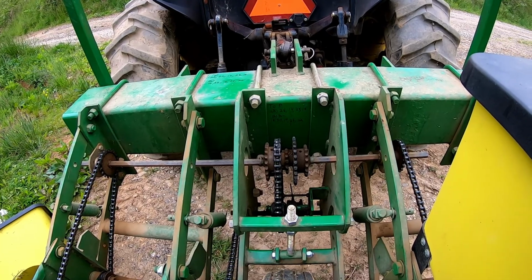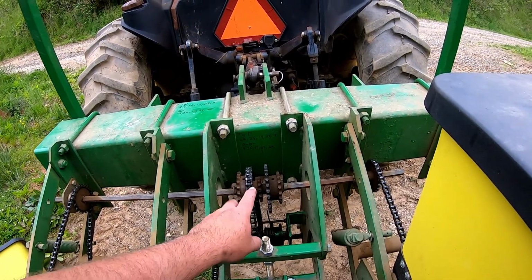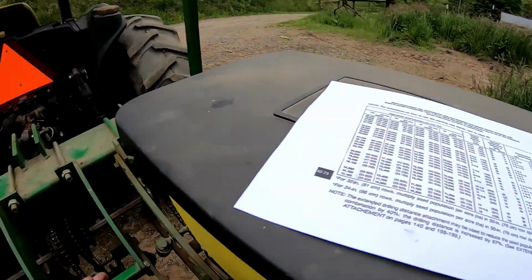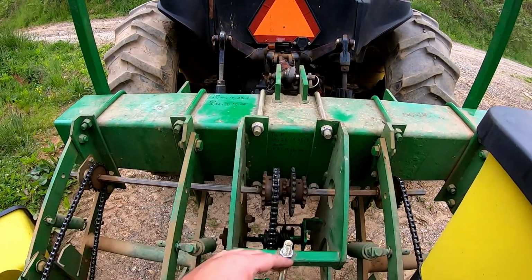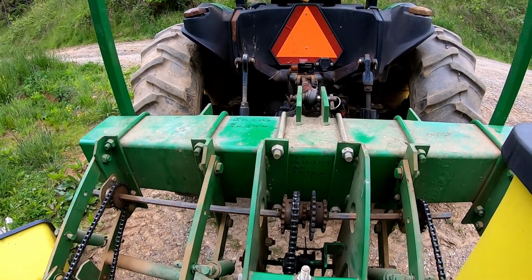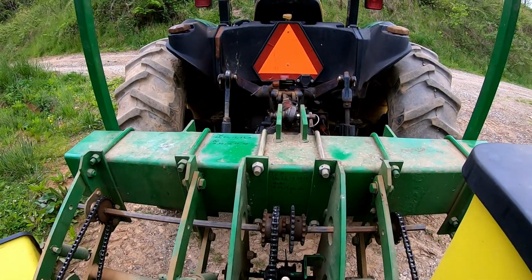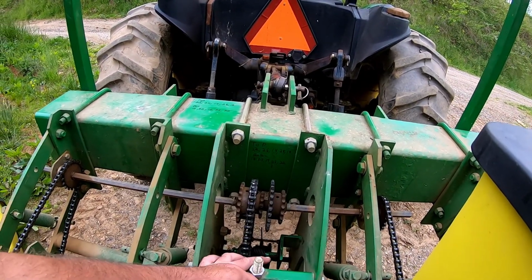So what you need to know is the number of teeth on your sprocket, both your driven and your driver, and then you need your handy dandy chart. And if you count them, might as well write them down. That's what we're dealing with, and I wrote it in 2 places. Just took a Sharpie, wrote it down. Been meaning to do that. But like I said, I knew which one I was going to yesterday. I could not explain it.